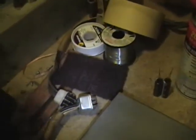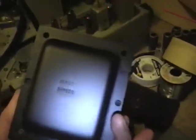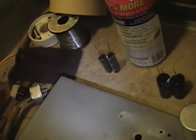While I had the power transformer and filter chokes off, I also polished the chassis down. It was pretty grungy and rusty looking originally. The capacitor can was really rusty, so I used some rust remover on it, sanded it down a bit, and painted it with some flat black enamel. I think it looks really sweet now. I'll be remounting that once I get done with everything else.